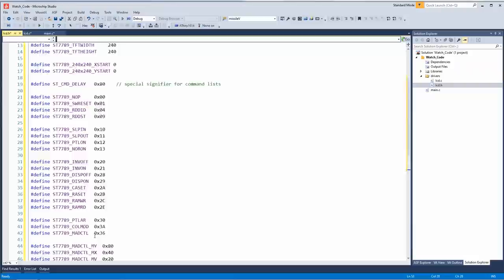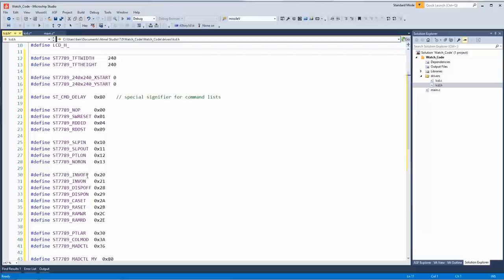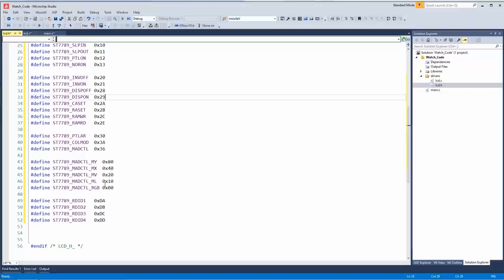And how it works is it's done via SPI, but you'll send one command and possibly some operands. So there'll be an opcode, an operational code, which will be one of these. And then there may or may not be operands after it. And that sets up a certain condition like, oh, I'm going to write memory. Then there's one of the IO pins on the screen that is actually command or data. So if you're sending a command, you put that, I believe it's low, and then you send the command, then you change that to high. And then the next time you write to the SPI bus, it'll be putting data into memory.